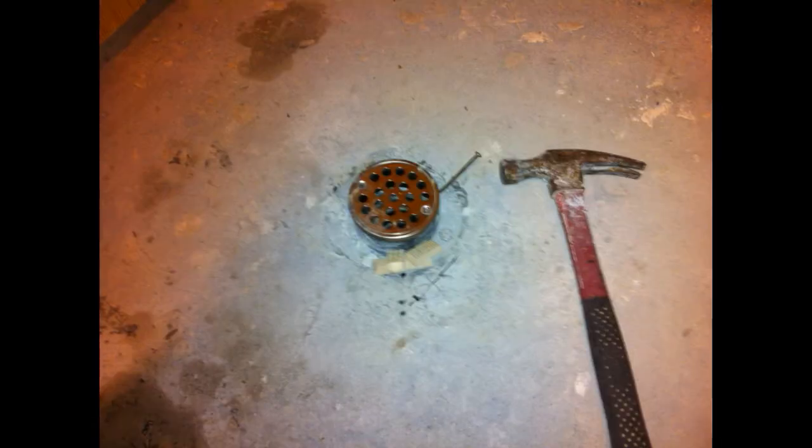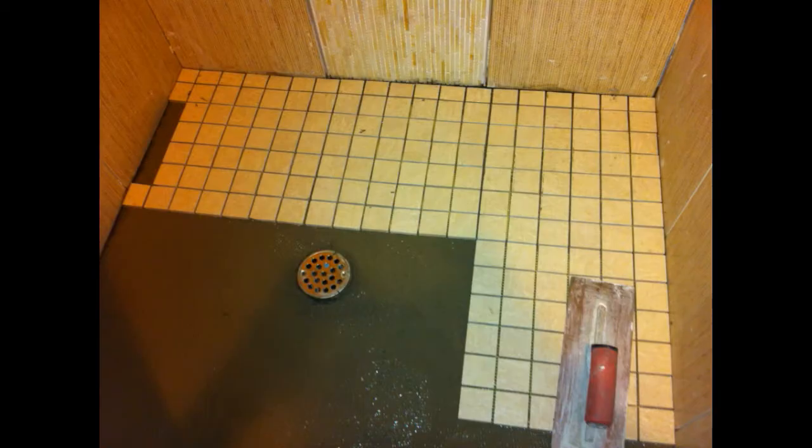Good. Now I'm about to do the shower floor. Those are weep holes. Make sure they're open. Put a little tile around them. Now I'm dumping my deck mud, which is 4 sand, 1 cement. It's called a dry pack. Now I floated my shower floor, pitched it. Now I'm just putting in my tile. Pretty simple. Just a beautiful shower floor.